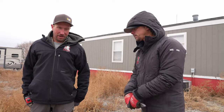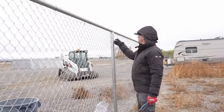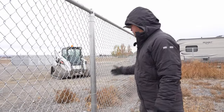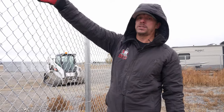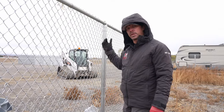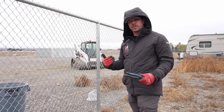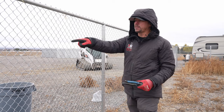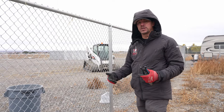Another nice thing on the commercial side: you can actually stretch mid-run on a 500-foot stretch and use those ties to hold your tension. Say this is a 500-foot run — halfway down at 200 feet, we tie this entire post with chain link ties, put our skid steer and stretching device in position, tie the post, put a bunch of ties on the top rail, maybe tie a second post. Once we let off, that wire doesn't move at all — basically makes a brace out of that box. Then we can keep going without going all the way to the end to stretch, because sometimes if you wait until the 500-foot mark you're pulling so hard you're over-stretching at the far end and getting nothing done at the near end.